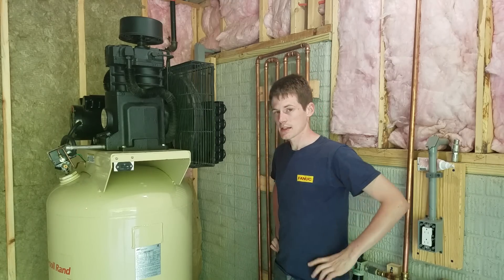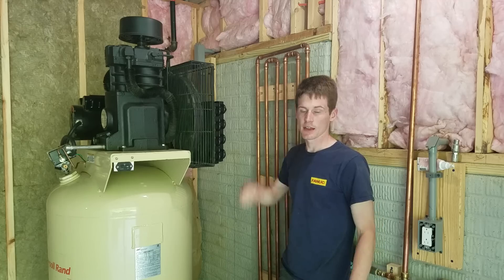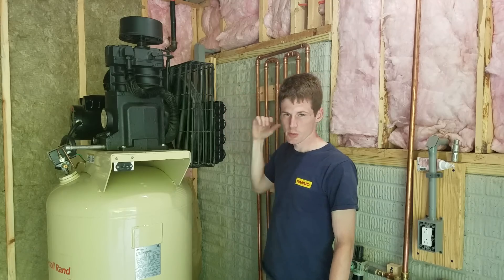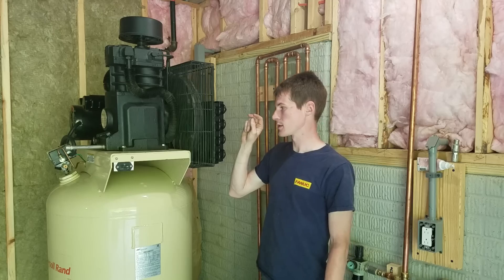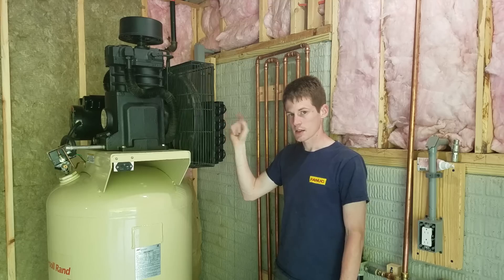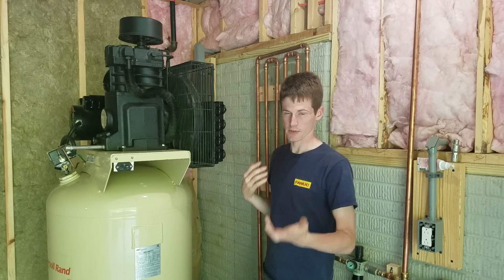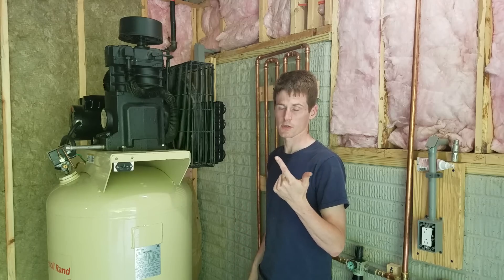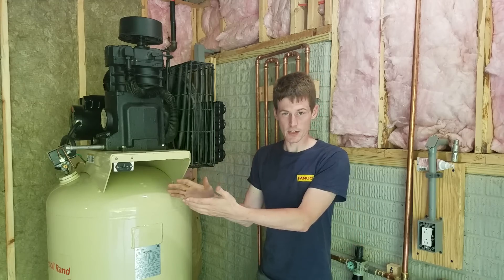For you guys interested in replicating what I have here, I have links down in the description to the cooler I used, the water separator, the lines, the plumbing, that sort of stuff. You can source a lot of this stuff locally. The only thing you may not be able to get locally is the transmission cooler. This one I have in particular has AN fittings on it that you use with copper flare or any style of AN fitting or hydraulic fitting. There are two different angles on those flared fittings — a 45 and a 37 degree — so you've got to make sure you have the correct fittings for what you're working with.